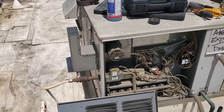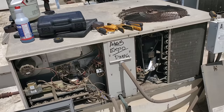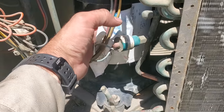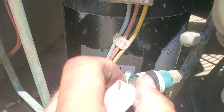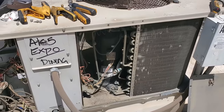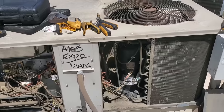This unit is a really old unit and I can't find any data on it. I've turned every panel apart trying to get a model number. I know this is an old Lennox unit, so I know the beginning numbers is GCS, but I don't know what size it is after that. When you come over to the compressor, you can get information off the compressor, but the compressor tag is all worn out too. Cool thing about Copeland's - you tear that off and there's actually another tag underneath that will help you find out your information. There you go: that is a ZR36, Zebra Ralph 36, K3 - so this is a 3-ton, 36,000 BTU unit. And just as I did that, I found another spot: it's a GCS 16-036 3-ton. Always look around - there's usually multiple places for the model and serial number.